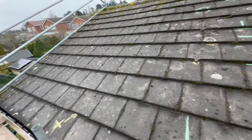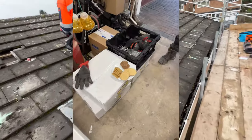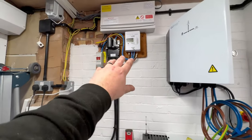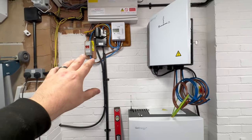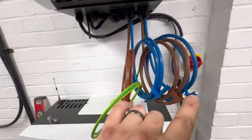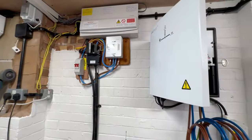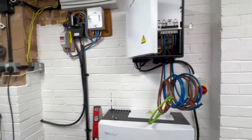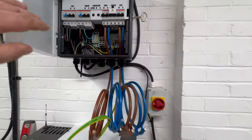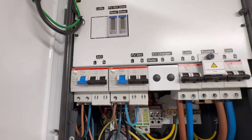I'll show you in the plant room — which is a very nice, tidy garage. We've got the PME supply on this one. We've got permission for 8 kilowatts of export. There is a mains isolator that's going to be repositioned so we can make better use of it into the gateway. In the gateway we've got our grid cables in and our load cables out — they're just loosely coiled here because I'm not sure what containment we're going to use to get our cables from A to B. We've got our RCBOs in here — 61009s, 30 milliamps.